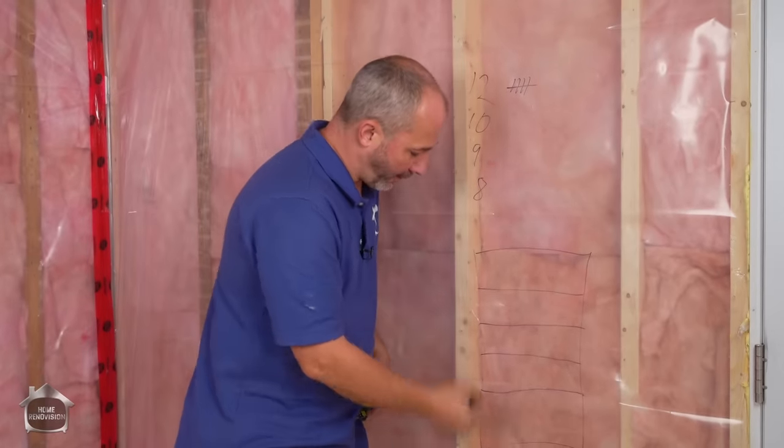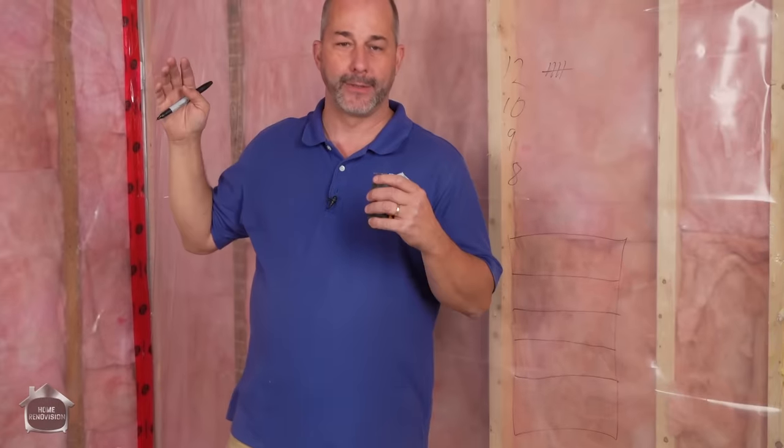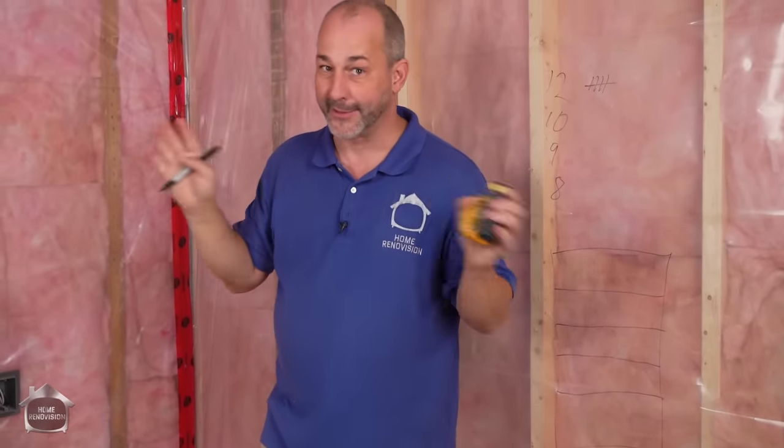Now, this long wall is going to be installed with drywall on the horizontal, not the vertical. Never install drywall vertically if you are dealing with old frames, because they're not parallel, they're not level, they're not straight. You want to go horizontal whenever you're dealing with structural lumber. If you're in a house that has steel framing, you can go vertical because they always install it perfectly level, and you can always adjust a screw if you need to. Wood does not give you that flexibility.